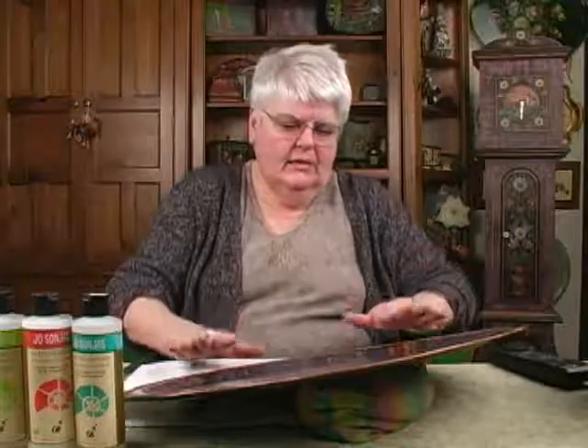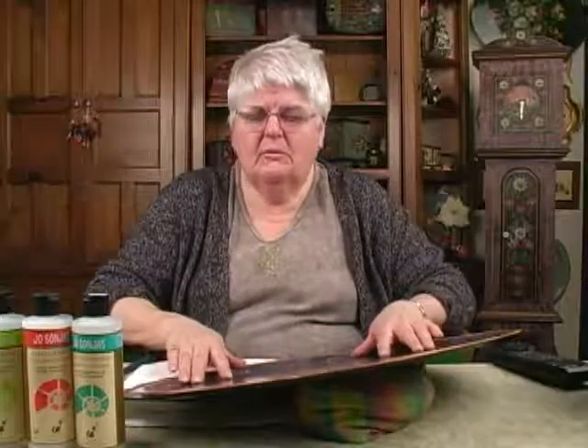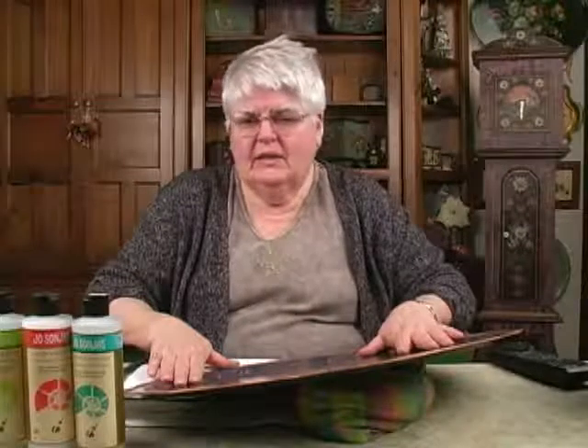When you have finished, let it dry naturally. Don't play with it or move it around, because that film is tender and you can mark it or start it peeling. Within a day and a half to two days, you can use it with confidence. We like to say four or five coats for an alcohol resistant finish, and remember that alcohol resistance develops as the varnish cures.